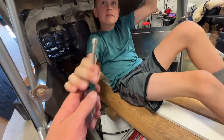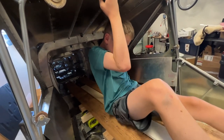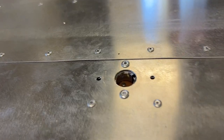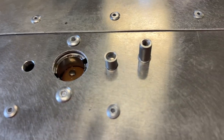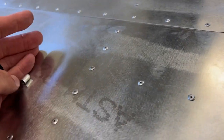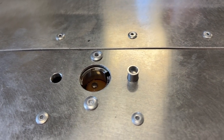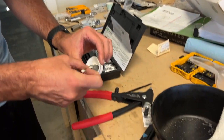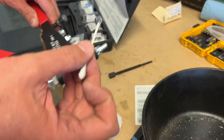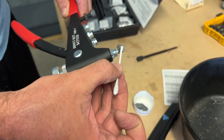He's going to hold the nut driver while I unscrew it, and then we'll pop in a couple of number 6-32 rivet nuts. With the light removed, we're going to drill these out to 7/32 final size — nice and snug. I'm going to wet rivet these with some JB Weld just to prevent them from ever spinning. It's a tight fit, but JB Weld will make me feel better.